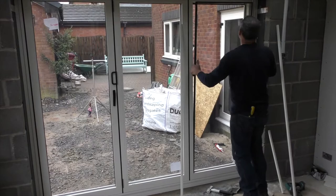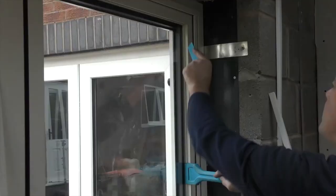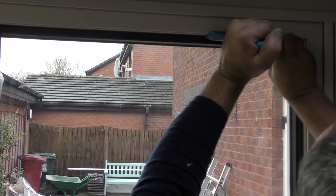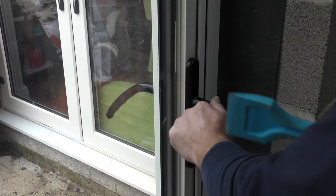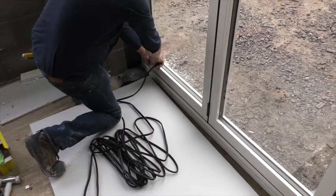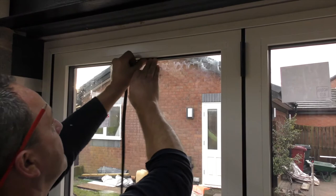It's important to put the beading back into the same position it was removed from. Fit an adequately sized packer between the back box and the glass. Place all wedge gaskets onto a clean surface to avoid any contact with grit or dirt. Provide at least an extra inch in length for any movement or contraction when there is a change in temperature.